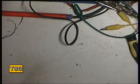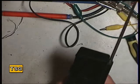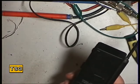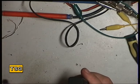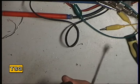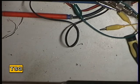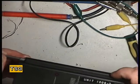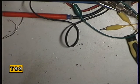It goes without saying that the telescopic aerial on these type of radios is absolutely vital for the SWR, and it has to be fully extended. Otherwise you end up blowing the output transistors, which would actually render something like this irreparable. I've just been measuring the antenna because sometimes these can turn up broken. With these being the age they are, and Tandy's having been bought up by a car phone warehouse years ago, you're limited as to where you're going to get parts. I've measured this aerial from the tip down to inside the set — you're looking at 26 inches or 650 millimeters. If you get the aerial wrong, the radio will be destroyed when used in transmit.